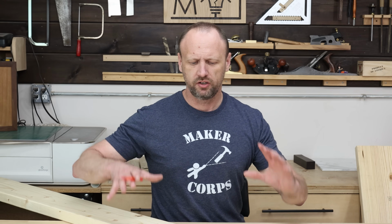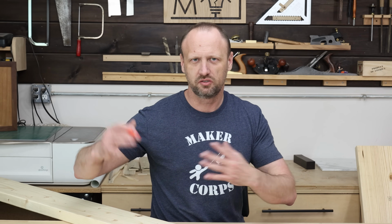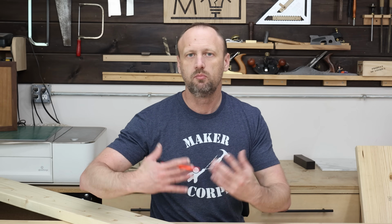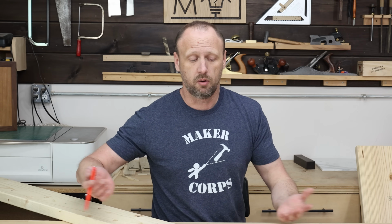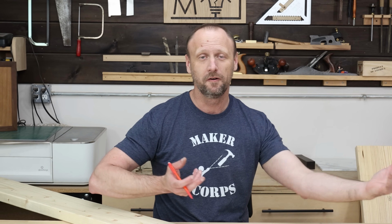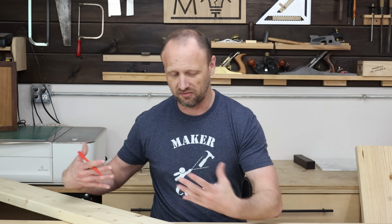If you're going to take this lumber and plane it down and actually make something nicer with it, not just use it for framing inside a wall, then maybe you don't want those radiuses, because that's more material you have to cut away to square up your board. That's lost material, that's lost money. It's also going to help so that you don't end up buying an eclectic mix where some are 1/8, some are 1/4, and you don't realize they're all mixed together. It's kind of hard to tell because it's rough lumber.